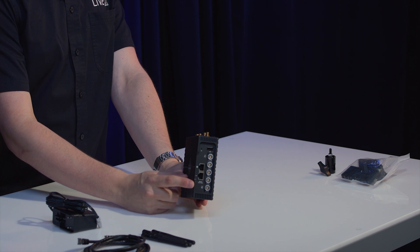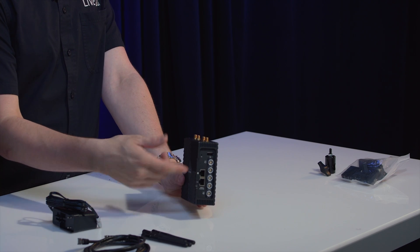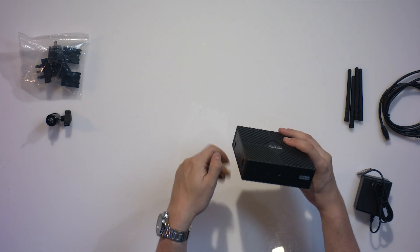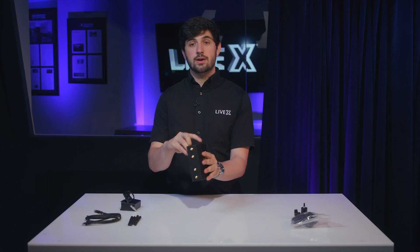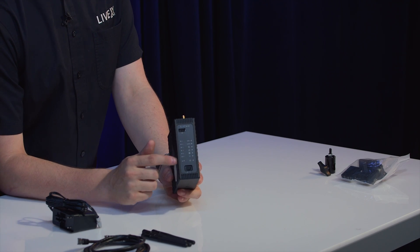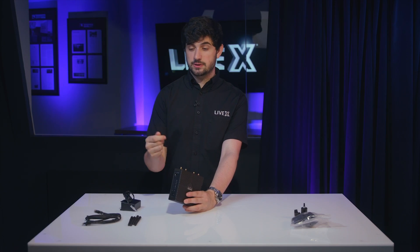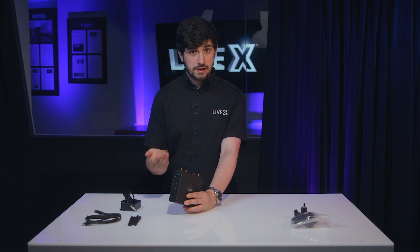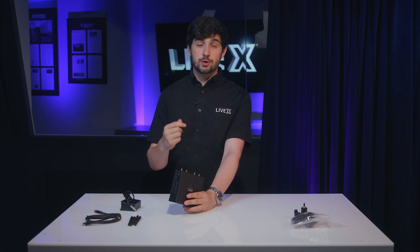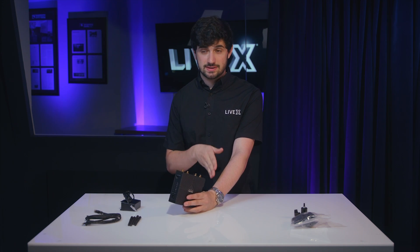Also over here are two Ethernet ports. One is PoE so you can power it that way, and the other is so you can interface with the device or access the internet over a hard line. On the bottom is where you attach it to a stand. On this side are six status lights. There were four node spots, but there are also two additional USBs so you can plug in USB modems. You can also get 4-pin Lemo to USB adapters to plug in any modems you already have and use those node spots.